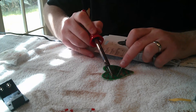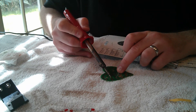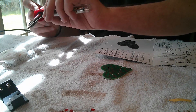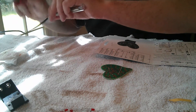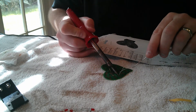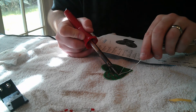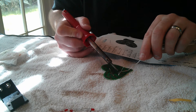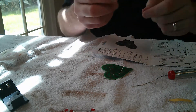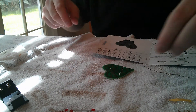Let's try that again — get it nice and warm, drawing up the lead a little bit. I keep wiping off my soldering iron; I want to try to keep the oxidation off. This iron hasn't been used in a while and it's got quite a bit of oxidation buildup. If you have a brand new iron, you might not need to worry about that quite as much. Probably a little too much solder — I think I'm going to switch to some thinner solder. So there's R1 done. Let's switch to R2; we've got seven of these to do.